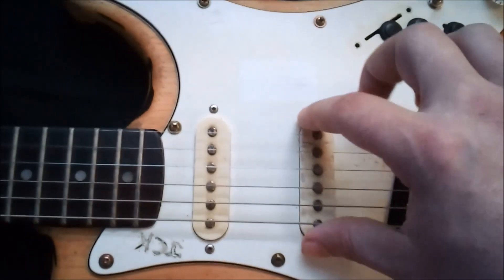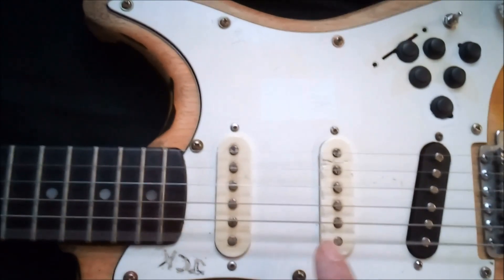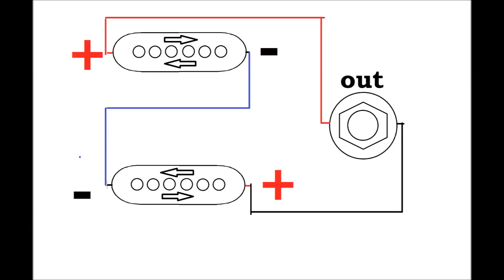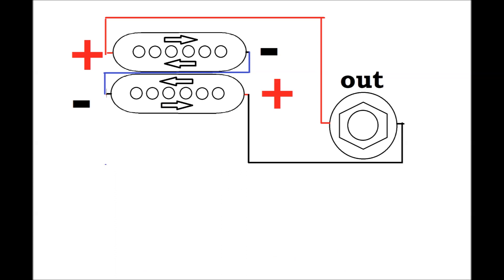The way they achieve this is by winding one pickup clockwise and the other counterclockwise. If you don't understand how that works or you wonder about pickup winding, you can watch the video in the description where I build a pickup out of household items. A pickup is a simple device — basically a few magnetized metal poles with a coil of wire wrapped around it. So in this reverse polarity wiring configuration, this is parallel and out of phase. Instead of the pickups adding sounds together, one will subtract from the other and you'll only get the difference between them, making a high-pitched, nasally sound. It also cancels out all electromagnetic interference or hum. And if you remember, with one wire in between, they're in series — and because of the reverse polarity of the second pickup, they're in series out of phase. Back in the 1930s, a man named Seth Lover did this. He shortened the wire, put the two pickups beside each other, put a metal plate on the back, and patented it. He sold this patent to Gibson. You probably know this kind of pickup — it's called a humbucker.